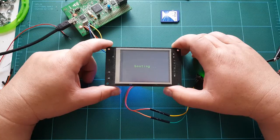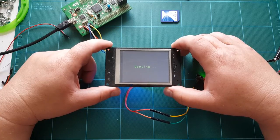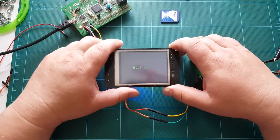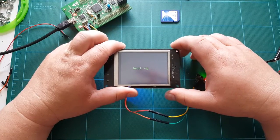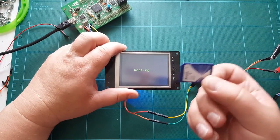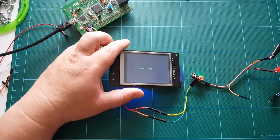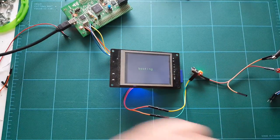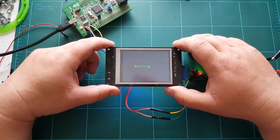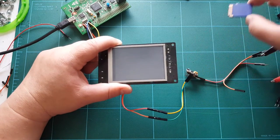This is a self-contained unit that has its own CPU, so it can operate unplugged - it should still be able to display the menu and be used, it just wouldn't be able to communicate with the printer. But it's just not working, getting stuck on the booting screen. I tried updating firmware - you put firmware on an SD card, stick that in, then power on the unit - but again it only goes to the booting message and gets stuck. So I'm going to try to reflash the firmware on this board hoping that will get it working.